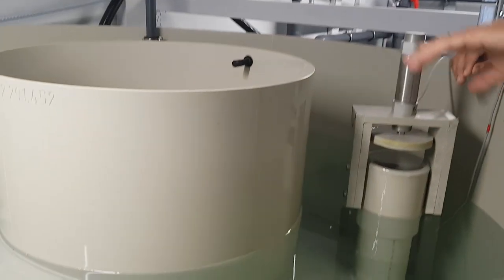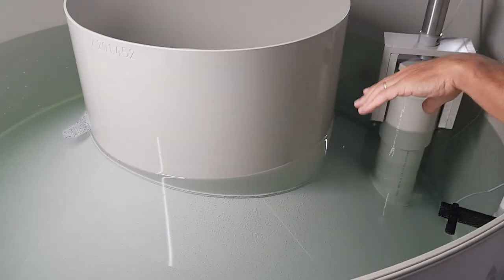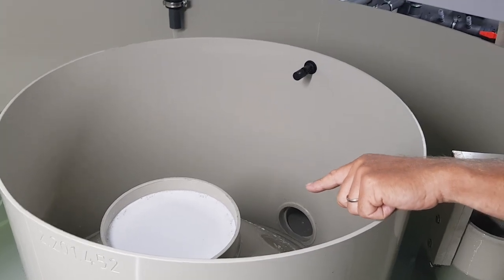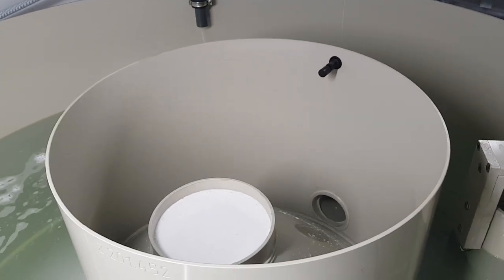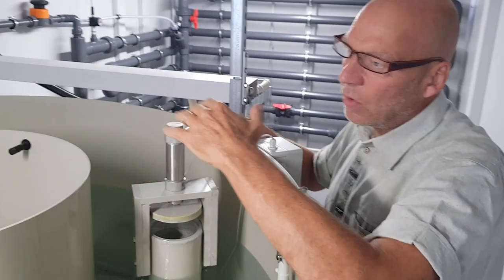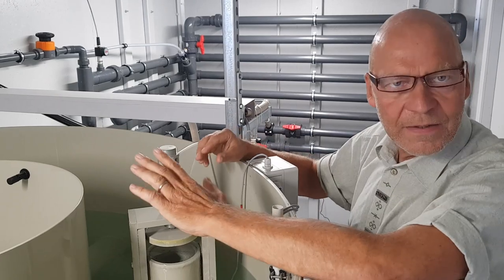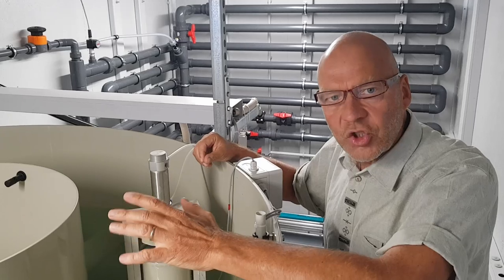You see outside is the clear water area, and if you look in the middle of the flotation unit, you see here the sludge discharge. This is very important — there are very fine bubbles released. We operate all our DAF units with a bubble size between 40 and 60 microns, so you can also say it's like a milky water. The bubbles need a little bit of time to float, so for this reason we started the unit two to three minutes before for discharging the sludge.